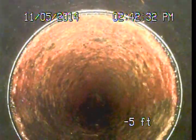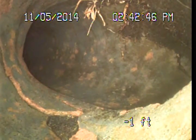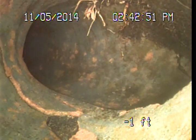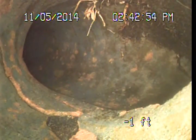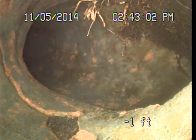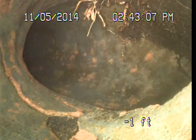I'm going to recommend that this piece of cast iron here — from just under the structure, that passes through the foundation wall and comes out into the clay — needs to be replaced. You'd want to put a clean-out here at this point. I'm also going to say it's a good idea to continue that replacement out to the plastic pipe at the far edge of the rear patio. The pipe's fairly shallow, a couple feet deep, so it's not a difficult section to replace. But you do have the terracotta tile patio that would need to be cut open and repaired.